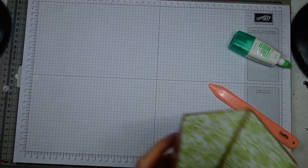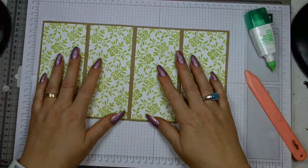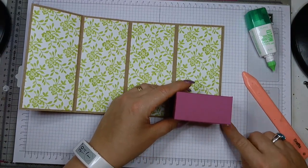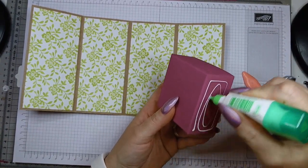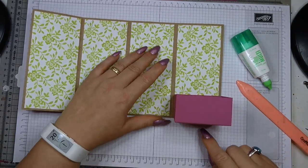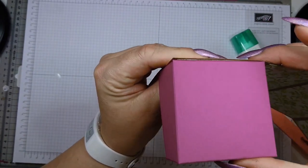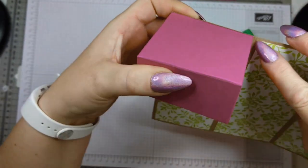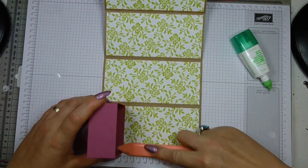There's no up or down when gluing the drawers in. You start with the first one, which goes exactly to this side. Add some glue and make sure it's exactly positioned — there's a small gap on one side and no gap on the other side. This is how you glue your first box in.